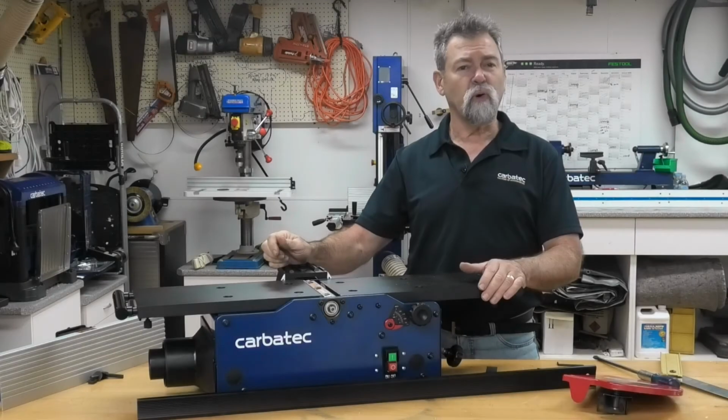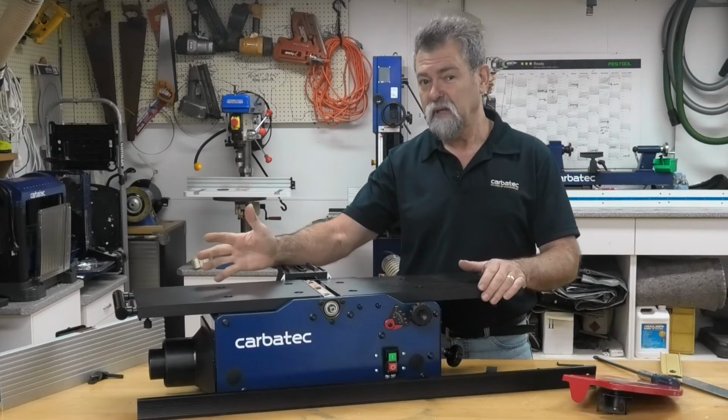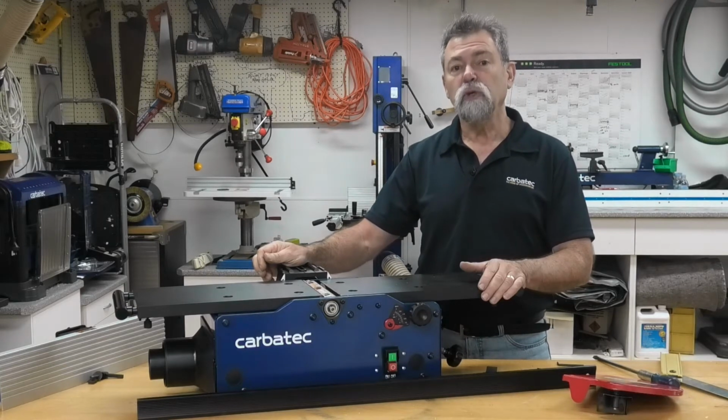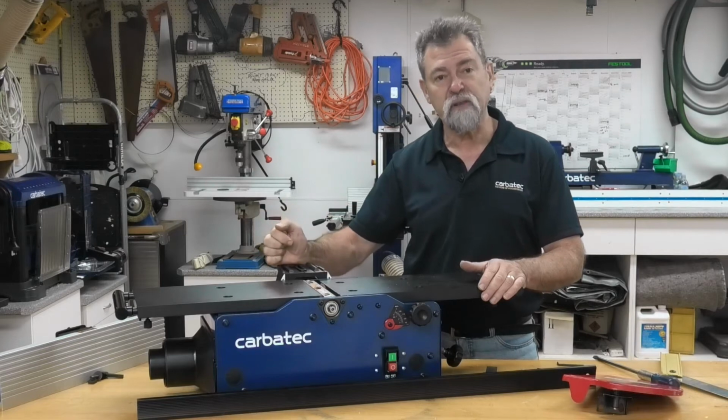If you try to do all 4 adjusting screws at once, the table will want to fall off the machine. This process may require a few attempts to get it right. If the table is out of parallel with the cutter head, you will need to adjust the closer side and the fence side independently of each other.